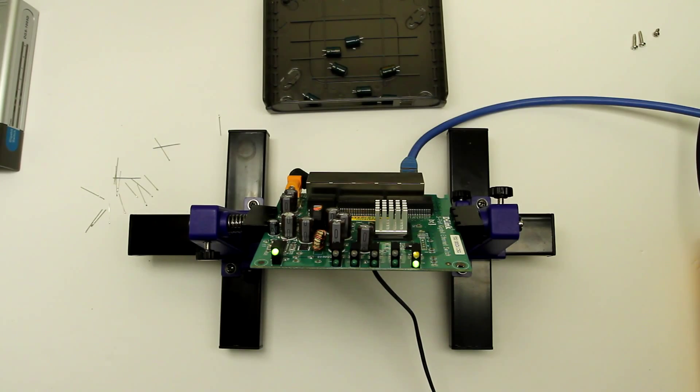That is good news. I spent about $5 on capacitors because I bought a little extra — like 10 of each — just in case, and it is always good to have capacitors around. I didn't really spend much money on anything else. Obviously those old capacitors are going straight to the garbage, and I think we have a winner. So if you have some weird problem with your switch and it's a fairly good switch — like 1 gigabit like this D-Link — you can just open it up, take a look, and maybe 1, 2, or all capacitors are bad. Just replace them for $5 and you're going to have a working switch.